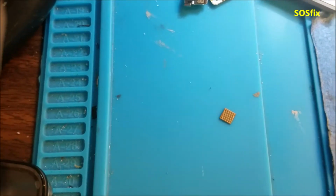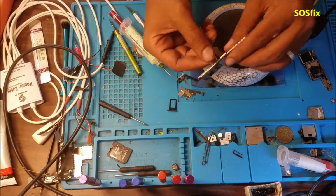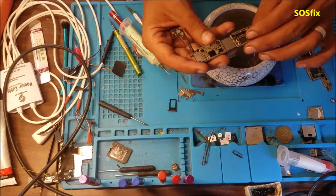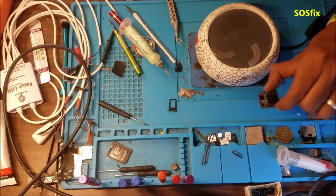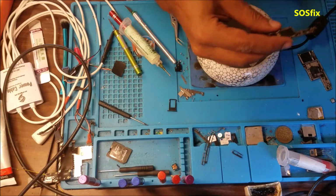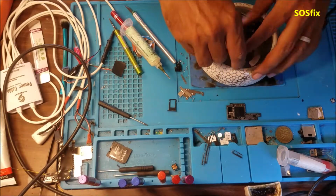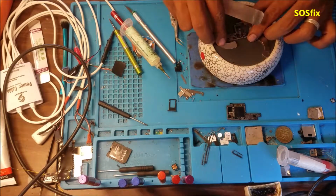Yeah, this was my mistake, and I have to fix my mistake. And this is how it works. Don't give up, keep trying. I got this bad motherboard, the iPhone 8 iCloud lock motherboard, from a friend, and I took the sound chip. I installed the sound chip in the top half, and I connected it to the computer. The computer detected the phone in DFU mode. That's good. It's not like at first when the phone had no power and was taking a lot of amps.